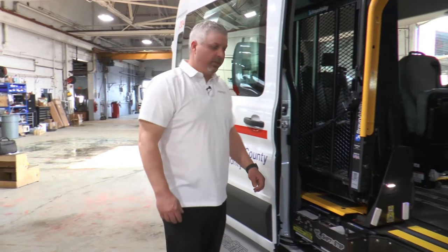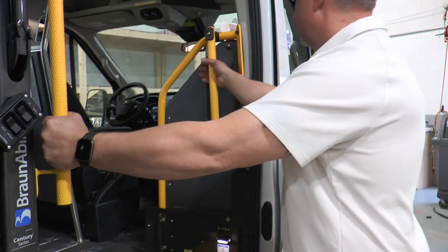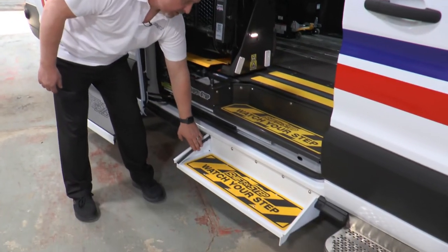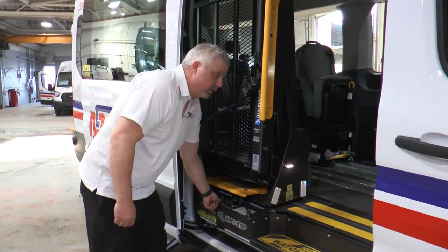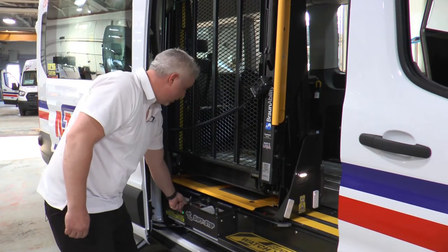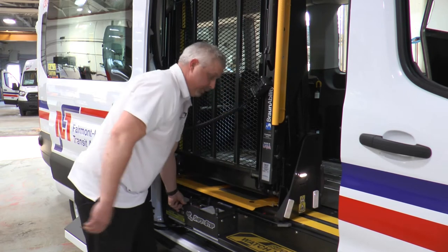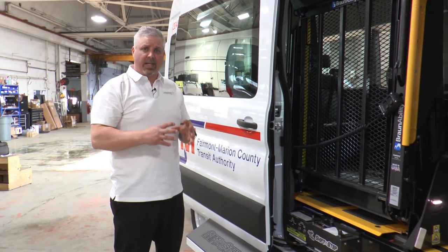Let's go over some of the safety features of the shifting step. There's an optional left-hand stainless grab bar and an optional right-hand grab bar. Each step has yellow slip-resistant safety tape. This is the optional bus step that has a cover to keep out weather. The electronic safety feature is the photo-eye — it'll stop the operation and you have to release and press the button again, and that works in either direction, left or right. There's also overcurrent: if something is in the way that the photo-eye didn't pick up, overcurrent will stop the shifting step.